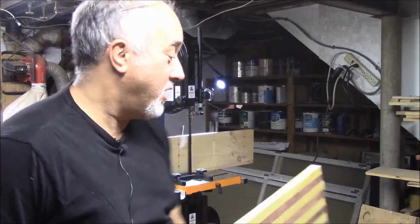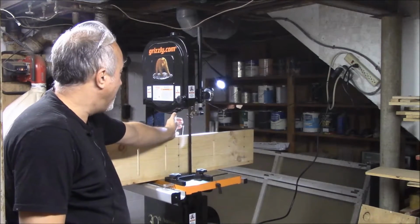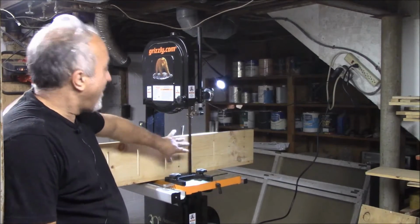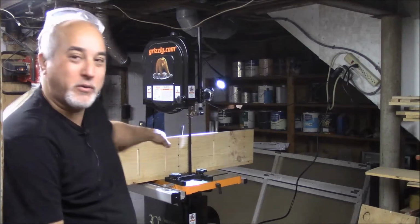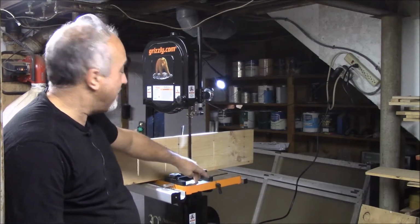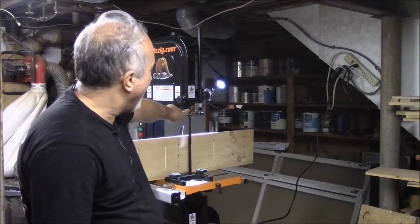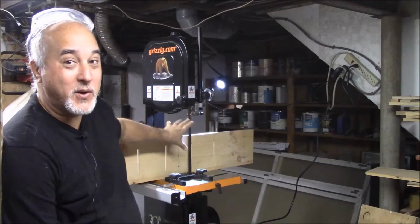I just got the bandsaw set up with a 3/4 inch resaw blade and what started out to be a log milling fixture, but it'll work well for a high fence. Got the blade all trued in for squareness to the table. Used the best and tallest square I had, squaring it at its extreme height, just to exaggerate any error and hopefully end up with a truer cut.